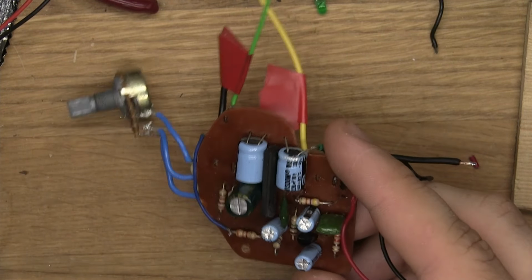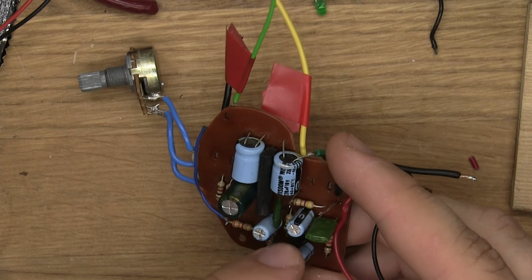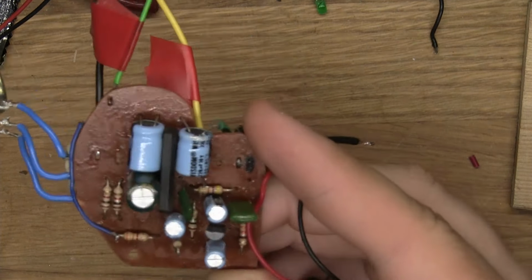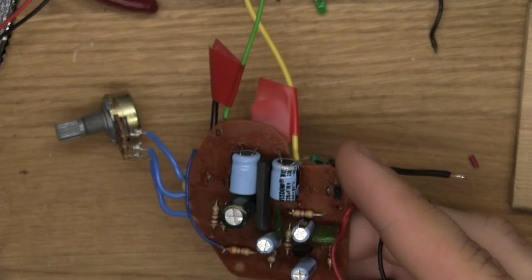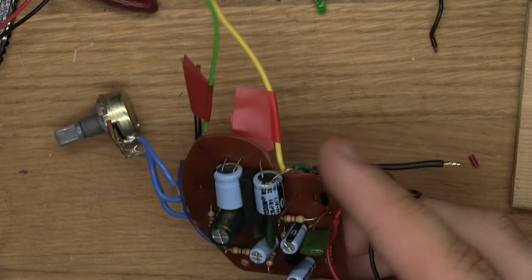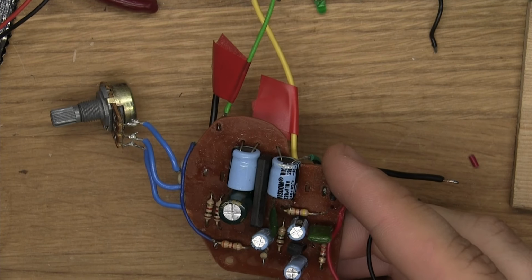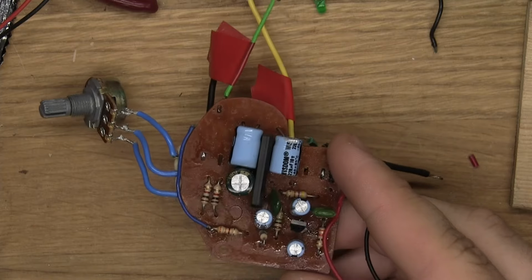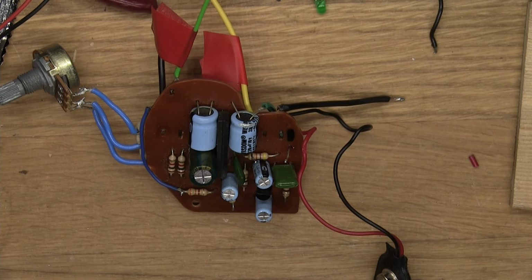The big change that I did, and hopefully you'll notice a difference in sound, is this transistor right here. I'll point with something so you can see it a little bit better. But right there, there's a transistor. It's a 9014, I believe. And I changed it out for a 2N5088, which are both oriented the same way, so it was very easy to do. I didn't have to do anything weird. I could just pop it out and pop the new one in.